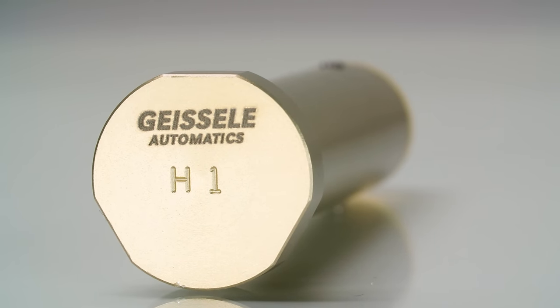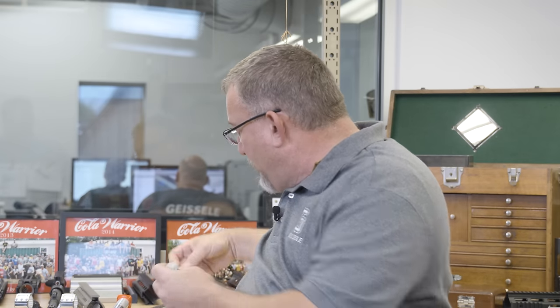One thing with this spring: the OD — the outside diameter — is identical, but the ID is not. With these three wires, the ID is smaller. So you can't just buy the spring; you have to buy a buffer with a reduced shoulder length. We have a mil-spec buffer that comes with the spring in an H configuration — it says H1, but H and H1 are the same thing. Inside the buffer, whether it's a mil-spec buffer or one from your M4 carbine, it has three steel weights — small cylinders — and in between them there are small rubber shims.